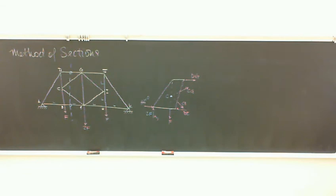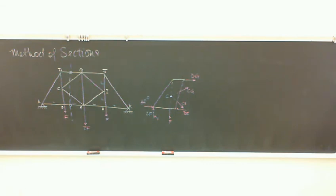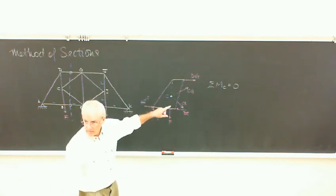Could we solve the moment about C? Yes or no? Well, let's ask two questions. One, is it legitimate physics to sum the moments about point C? I won't write this down in ink. I'll write it down in chalk so I can erase it if I need to. Is it legitimate to even write that and say, suspect it could be useful? Not saying can we actually use it. Is it physically legitimate to do that? Of course, we can. We need equilibrium everywhere, so it's legitimate to do that.